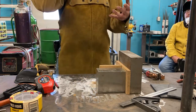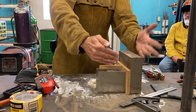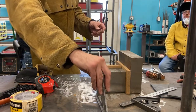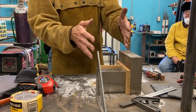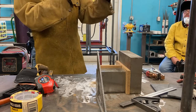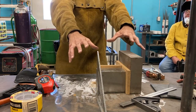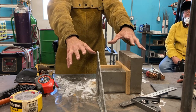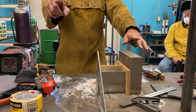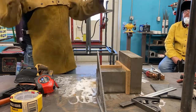If we think mentally about our work surface and using blocks or even our squares as these other datum surfaces, if we look at the print and you're gonna see A, B, and C on the print, if we take the A, B, and C on the print, put the A, B, and C on the table, that's our starting point. That gives us a start here on the print, like the corner. And from there, the whole thing just grows.